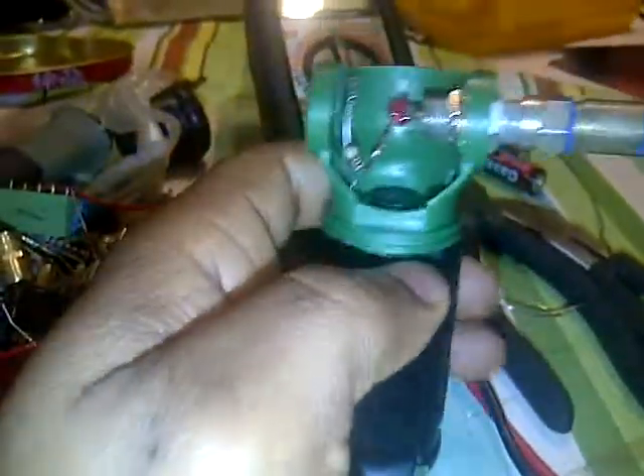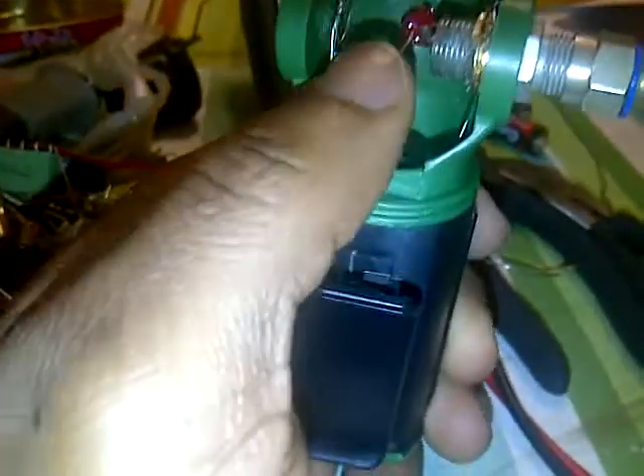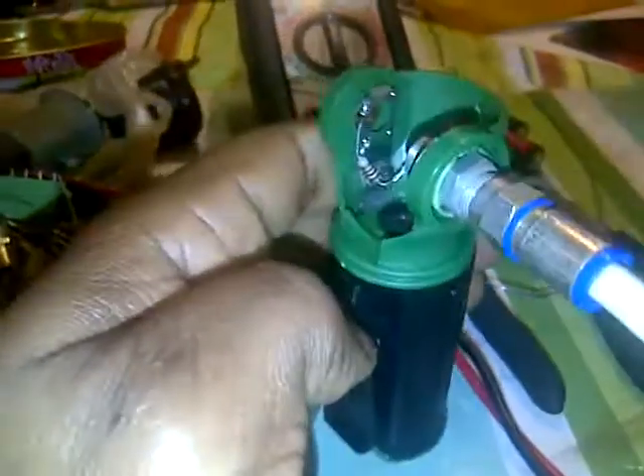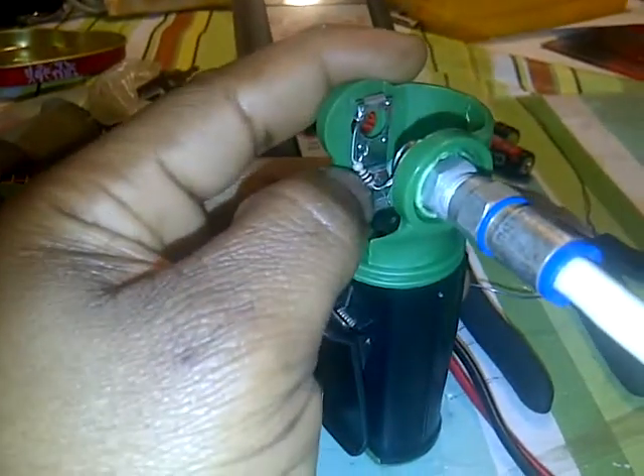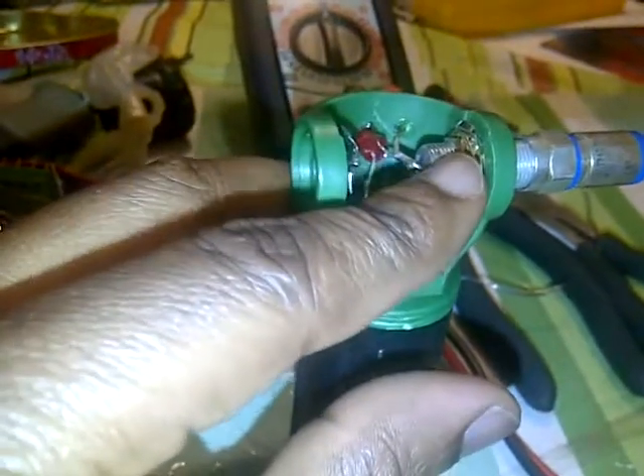To make this LED come on, you need to find a way to complete the path of the voltage or current from the battery — from the positive side to the negative side. When this path is completed flowing through the LED, then the LED will be on; otherwise it will remain off. Here we have a 100 ohm resistor connecting from the positive side of the battery, going through the anode of our LED — the anode is the longer side. It then goes to the cathode of the LED. Now this portion should go to ground, but instead it went through the middle part of the connector, whereas the outer part of the connector goes to ground.